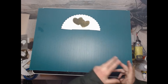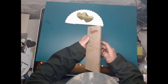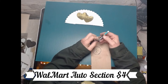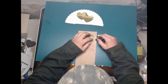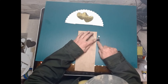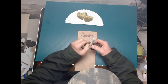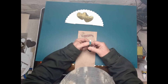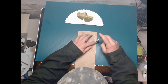That covers inlays cut all the way through. The next type is inlays not cut all the way through. To do that you're going to need one of these — it's actually used to measure the depth of tread on a tire. The way we use it: hold this on the wood, push the part down that isn't touching, then pick it up and read the measurement. This is reading out at about 0.3 — that's the thickness of this wood, and that's what you'll need to know.